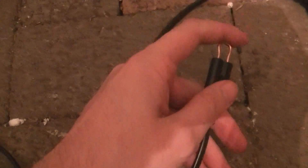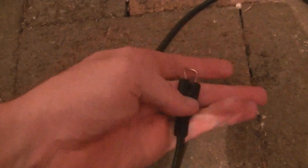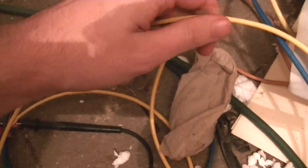It's definitely about 110 degrees Fahrenheit. We are getting a smell off of it. The copper nearby is slightly warm, but that's just conducted heat. The good quality wire is stone cold by comparison.